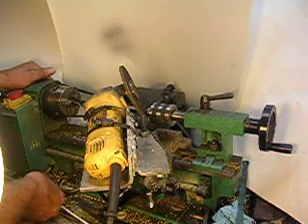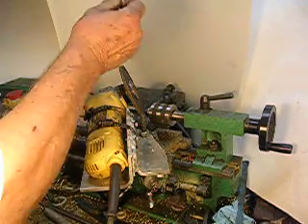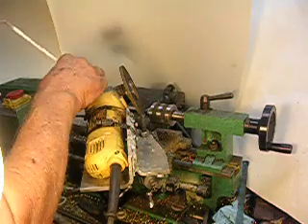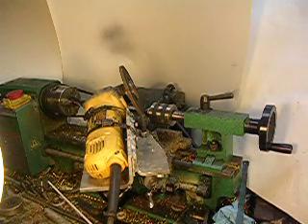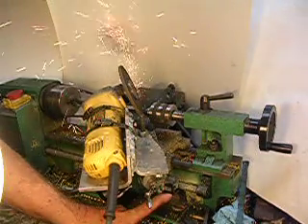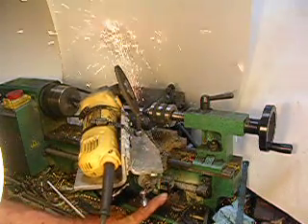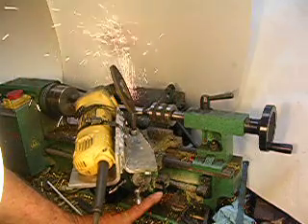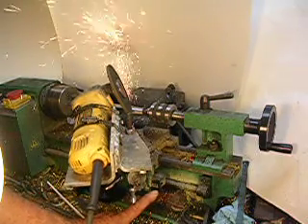It works very, very well. Now let's see if we can make it work. What I'm doing is turning this drill bit down — it's about a three-quarter inch shank, and I'm turning it down to a half inch so I can get it into my half inch drill press. You can see it's grinding a bunch, putting out plenty of grinding, and I have plenty of power with this Dewalt angle grinder.